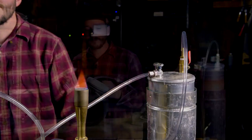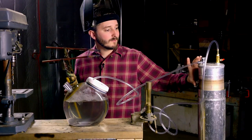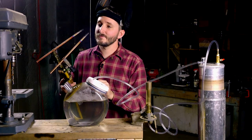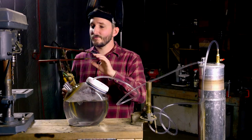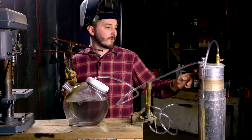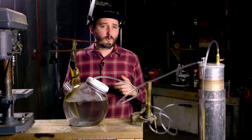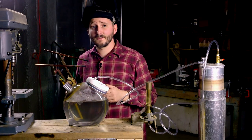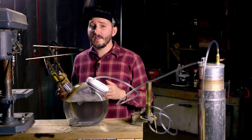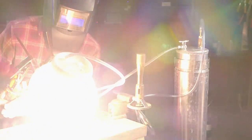Only the creation of the carbon monoxide is eroding these rods away. So in exchange for this rather substantial volume of gas, we've only eroded these carbon rods a couple of millimeters. To consume these entire carbon rods would be way more than enough to fill this gasometer completely to the top probably more than a hundred times, just as a rough guess. This is a great process if you want to generate a large volume of flammable gas quickly using an electric power supply.